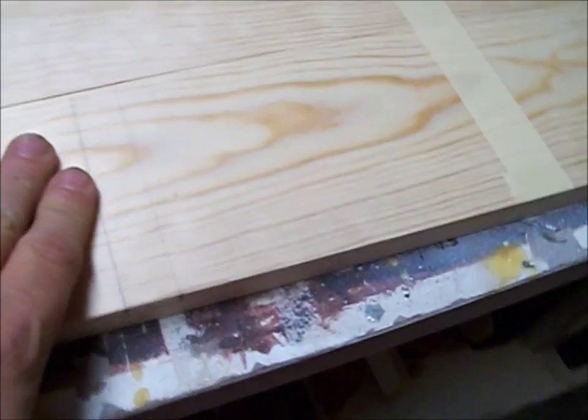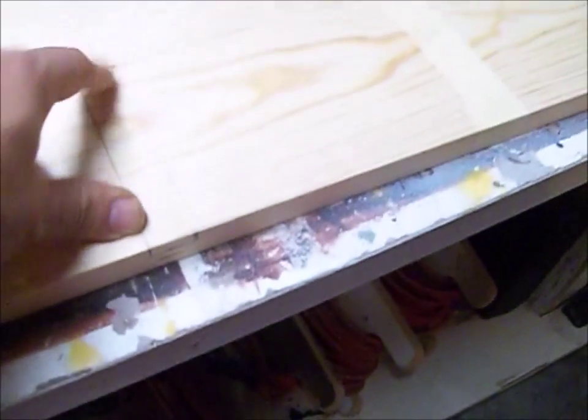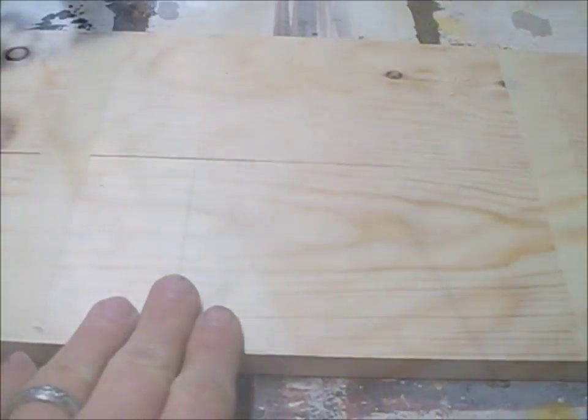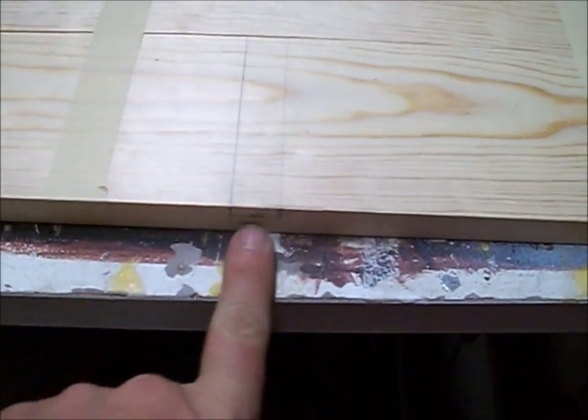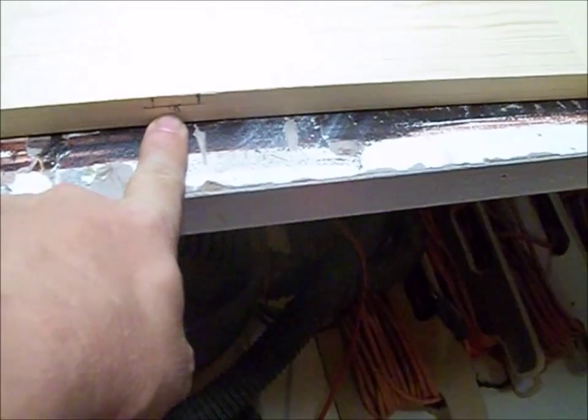I got to set up the crosscut sled and set it to a 1/4 inch depth, because I'm going to go with 3/4 inch dados, because the boards that I'm going to be making for the shelves are 3/4 of an inch wide. So the dados are going to be 3/4 inch dados. They're going to be a 1/4 inch inset. That way it'll give me some pretty good meat in here, so give me a 1/2 inch, so they'll still be pretty sturdy.